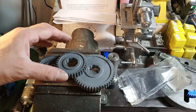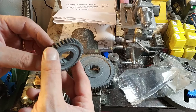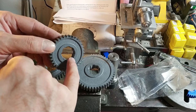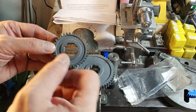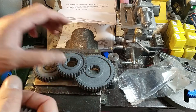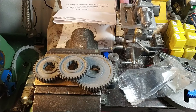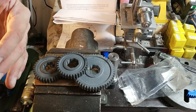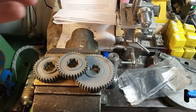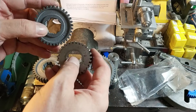The next step was to make the drawings of the gears, so I made the 3D drawings. In particular, I took care of the dimensions of the bore hole. These are the gears that were missing with the lathe. It is curious that I made them to have all the metric pitches, and now I have to use them to make an inch pitch. The important thing is that the material will resist.